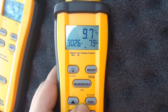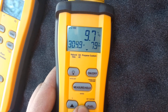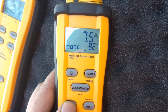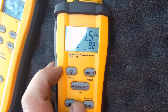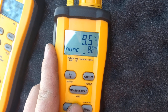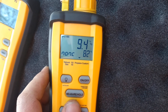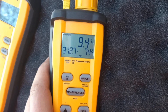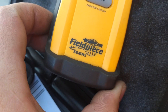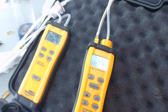I'm going to chalk this up to bad burners — we're going to get these burners replaced and it should be a lot better. CO2 is 7.5%, that's good. O2 is 9.5%, higher than it should be. Non-condensing, 82% efficient. This is the SOX3 and the SDMN5 for furnace adjustment.